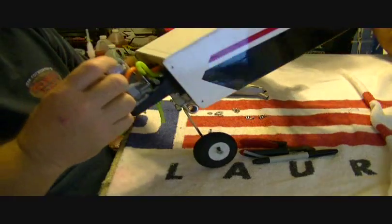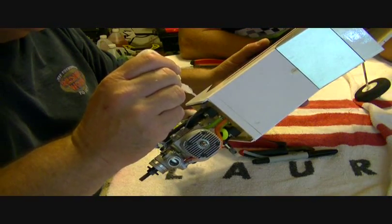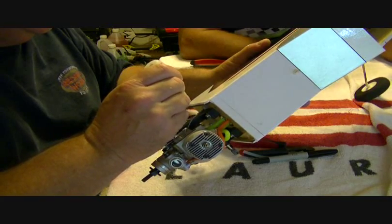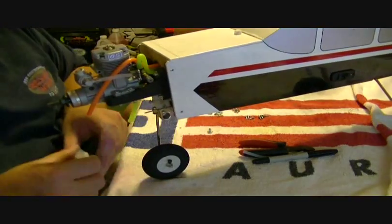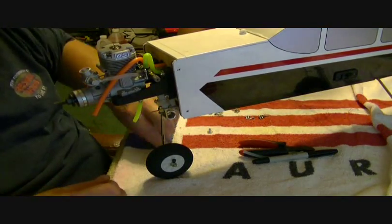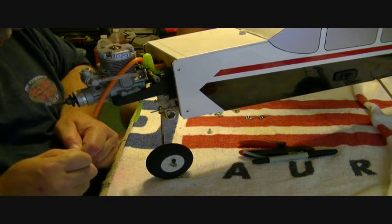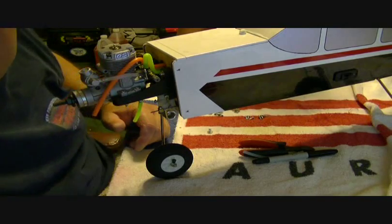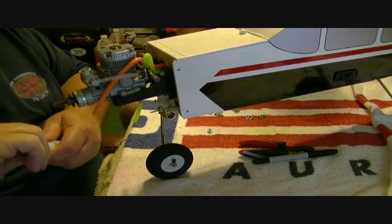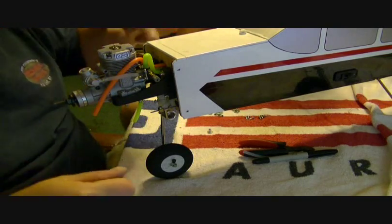This will help harden those holes where the threads will really tie in tight when you put the screws in there. But it's important to go ahead and thread your screws in because you want it to fray the wood and make the threads, so it works real well. If you do it with just your drilled hole, it doesn't work as good. So drill your holes first, and then screw your thread in, and then come back and put your glue in it. That way the glue flows into those threads.